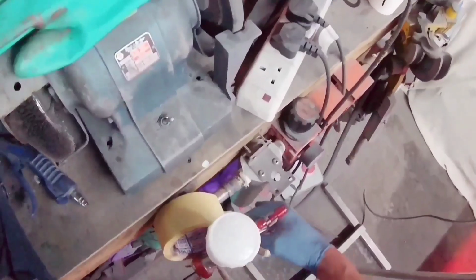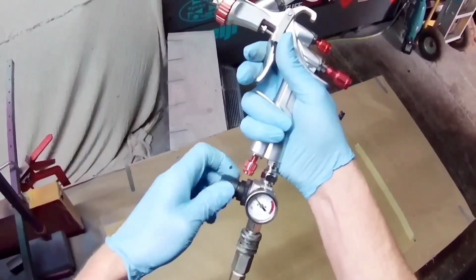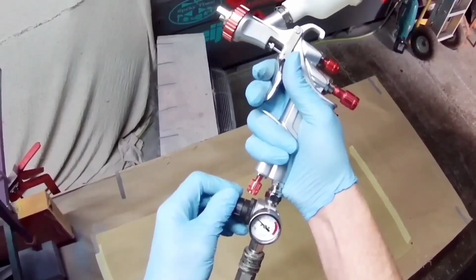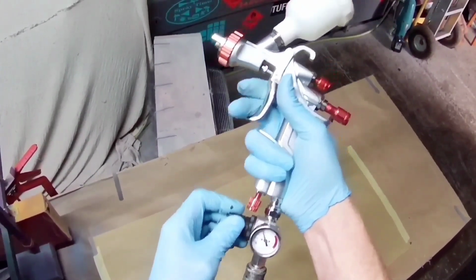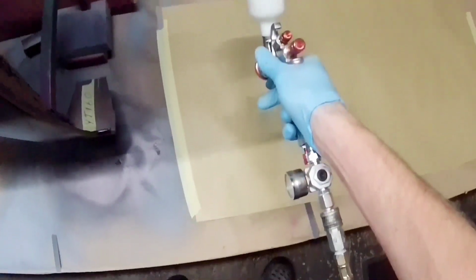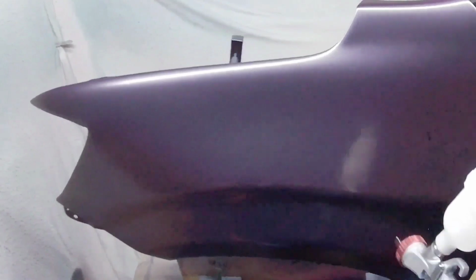One of the things that they also copy from the original W400 or Kiwami 4 is they're actually quite good on air consumption. Now, if you're looking at any of these guns, you will see that the amount of air that these things are supposed to consume varies widely. For example, the YT160 was quoted on AliExpress, which is where I got it from, as requiring 15 CFM of air. The R500 was quoted as using 4 CFM of air. Now, neither of those are right.